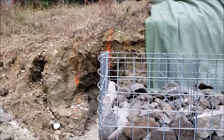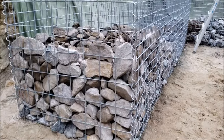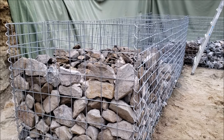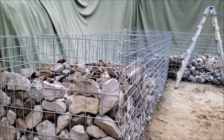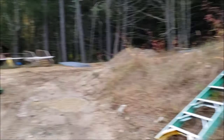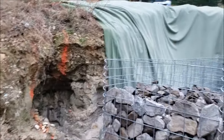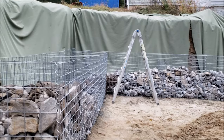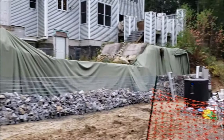That is a box — hand stacking worked out really well. The cattle panel is the end piece because I need to match the top and bottom width of 50 inches rather than 48 for the goat panels. It's looking good, I'm feeling good. Hopefully three more days and we'll be done with this bottom tier. That includes the drain tile — the black pipe over there — going behind this, required per the structural engineer, even though this should drain right through. Then gravel on top of that, and then we can start putting together the second tier cages.